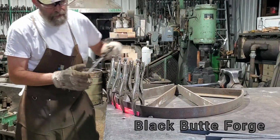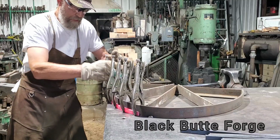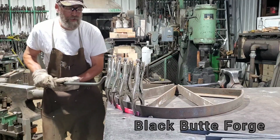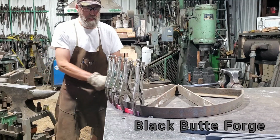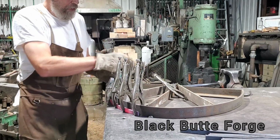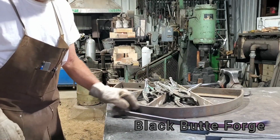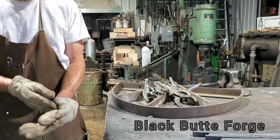You're doing hot work too, but clamps like these are serrated, so if you set them too tight, you're going to what we call mule paw your clamp, or mule paw your material, keep that impression in. A little more, and that's it. Alright, in order to keep them the same, if you notice, as soon as I do the work, I take the clamp off. I don't leave the clamp on and come back later. That's something you don't want to do. If you do that, that one will be different from all the others.